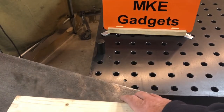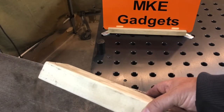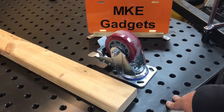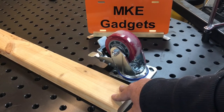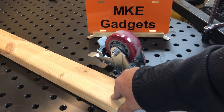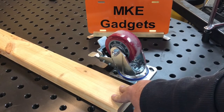So what I've got to do is take the casters off, measure them, and drill and bolt this on. Hopefully I have long enough bolts. The Rhino cart has four casters, so I've got to cut four spacers from a 2x4. You want to cut them out of the same piece of wood — you don't want to use a couple pieces of scrap because every mill has different thickness 2x4s. They could be off by a little bit, and you don't want your cart rocking on you.